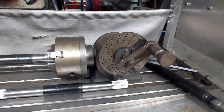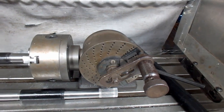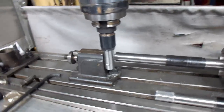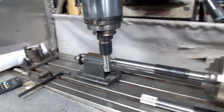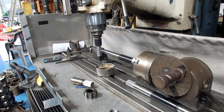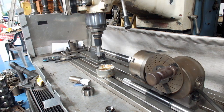Our index head has been set up so that we're going to be cutting 32 splines. If you look in your handbook of information on these indexes, you'll find out what the pattern is. We've got to support it over here on this end. We're going to make four passes on each spline — three coarse cuts and one fine cut — then we'll flip this thing around and start the other spline. We're going to cut our splines about an inch and three quarters long.